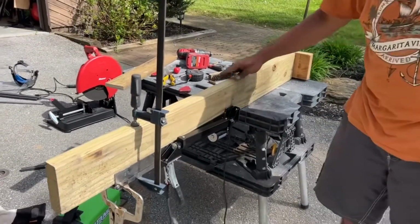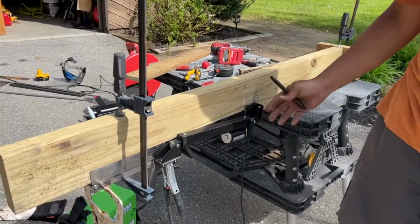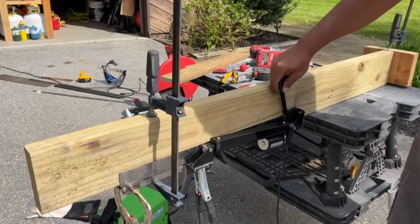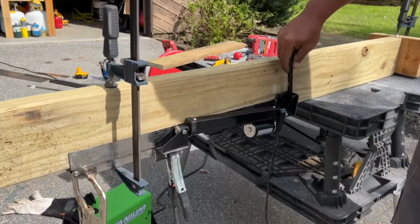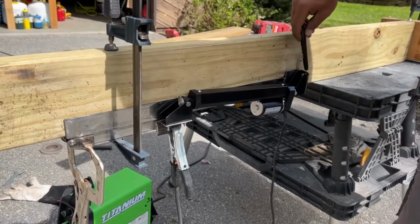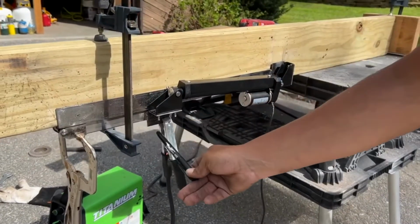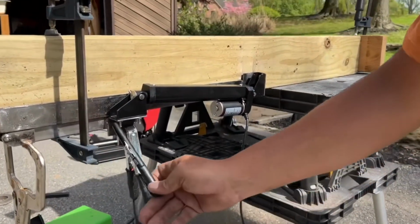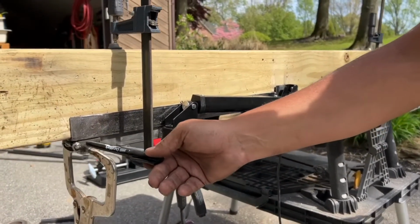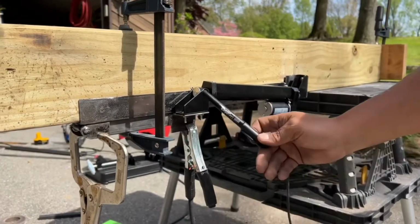Now I've flipped everything right side up. So this would be exactly how it would be laid out if you were mounting it up underneath the rafter in the RV. Those two L brackets I've mounted and screwed in the actuator to. So we've got a tab here and a tab back here. And that tab is connected to the arm that'll come down to hold the actual TV. For now, we're about to weld the hinge. I made two tabs, one on each side, to weld onto the square bar that'll act as a hinge for this thing to fall down.